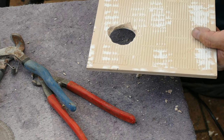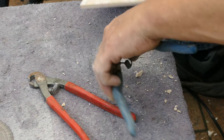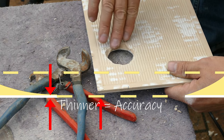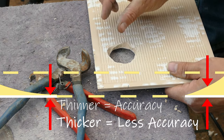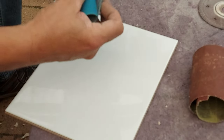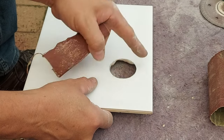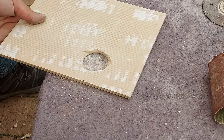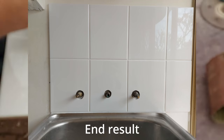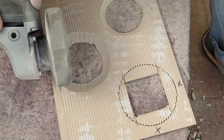In doing this, you can now see why I bowled it out with the grinder. This is why if you try to snap off the whole thickness of a tile at this stage, there's a good chance you're going to crack it through. But if I wanted a really nice neat edge, I could get the grinder now and gently bowl that away to make it thinner, then get myself that beautiful edge. I'm pushing with mainly a downward action — pulling it up can cause it to chip. That's your trick: just bowling it out. But if you wanted it absolutely perfect — perhaps you're going to see the hole with a pipe going through — I can get my grinder and wind that out to the sides.